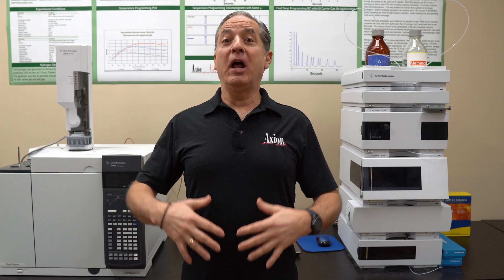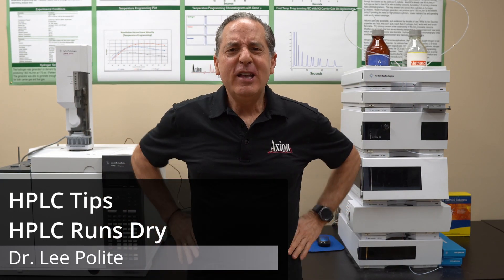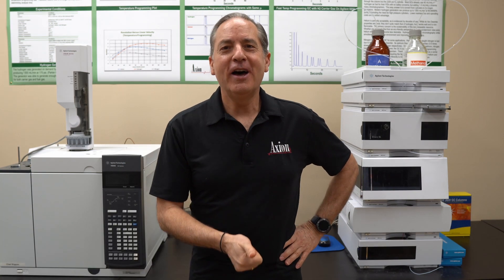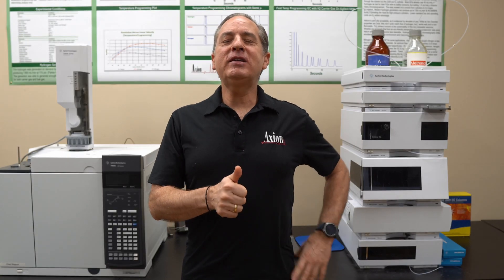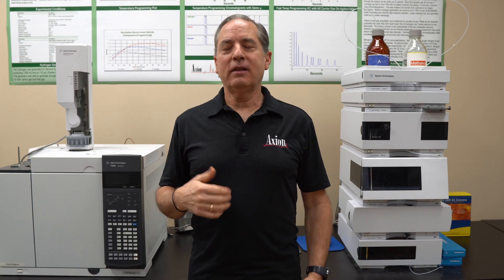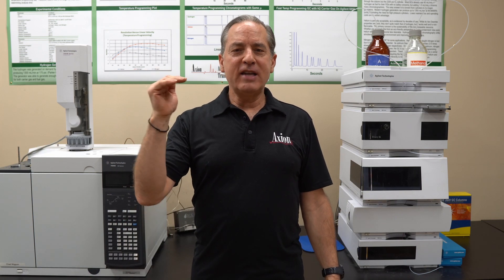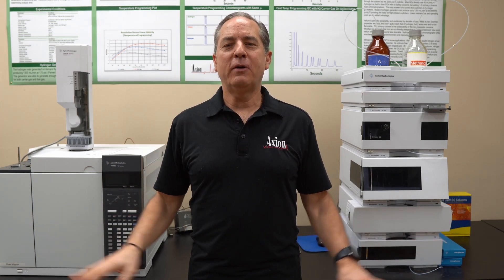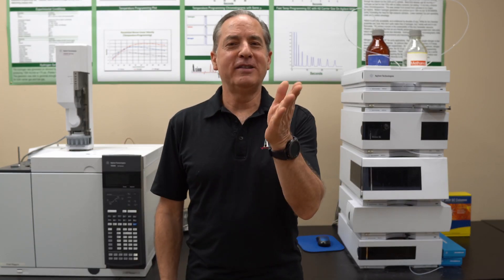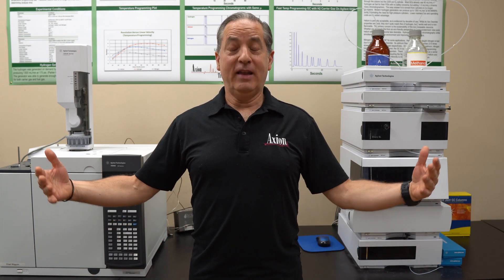Here's a good question from someone anonymous because they let their HPLC run dry. What do you do if your HPLC runs dry? First statement: don't let it run dry. A trick is to set a minimum pressure on your HPLC pump — if you're running at 2,000 PSI or 100 bar normally, tell it to shut down if it ever drops to 5 bar. Basically, if it starts pumping air, shut the system down.